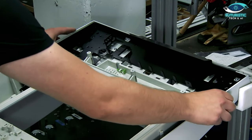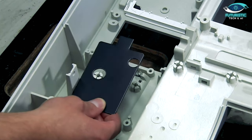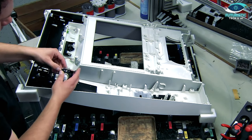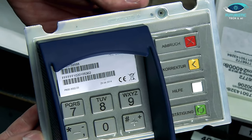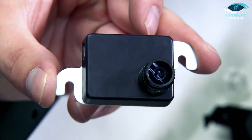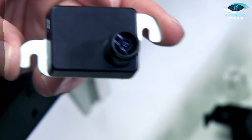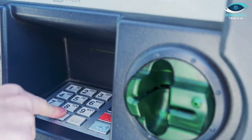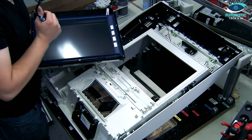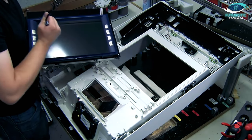Inside, the operation panel is aligned and assembled, containing everything necessary for an ATM transaction, from the card reader to the keypad. The keypad also plays a critical role in encrypting users' identification numbers. Furthermore, up to 3 security cameras are installed to record both the keypad and the cash tray. The monitor, card reader, and receipt slot are also installed as per the bank's requirements.